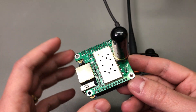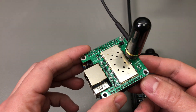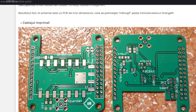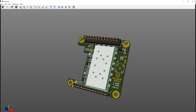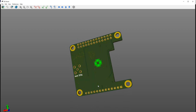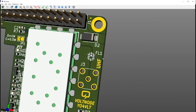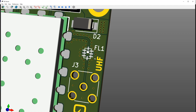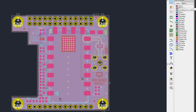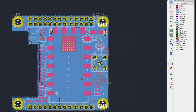The Rowlink community also provides a PCB design, but there were a few things I wanted to improve. Their PCB used a double-sided load and was only two layers, likely to keep cost down. I redesigned the layout to a single-side load and used 4 layers to help with the 50-ohm transmission line to the antenna, and also to improve heat dissipation by having massive copper planes on the internal layers to carry heat away from the SA818 module.